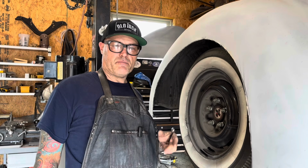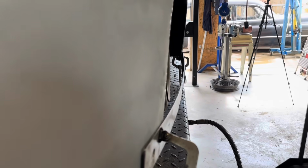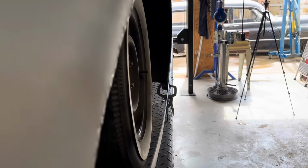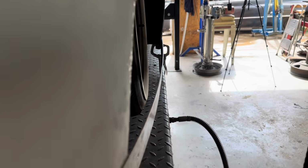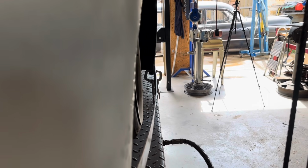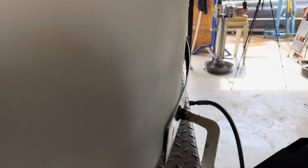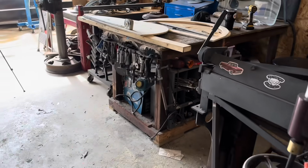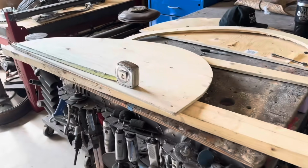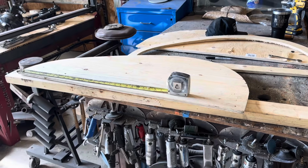All right, now that that's done, back to the normally scheduled program. So having my straight edge clamped to the fender, front and back, you can see there's just a slight arc. Using the straight edge will help you find what the true arc wants to be based on, you know, fender shape and whatnot. So I'll transfer that to my 2x4 and cut it out over here and then screw that all together, and then we'll start bending sheet metal. The buck should be just about ready to go.